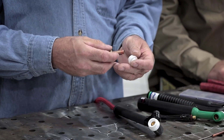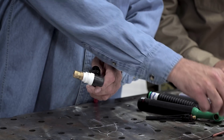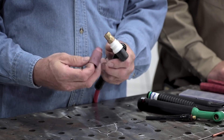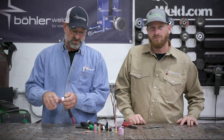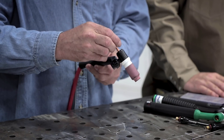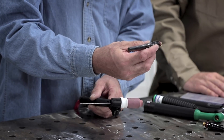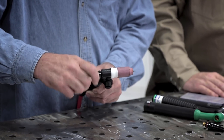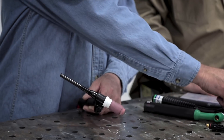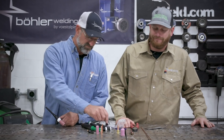Put the insulator on the gas lens and screw it into the TIG rig. This is the number eight cup - C8 - screw it onto the gas lens just finger tight. Then insert the 3/32 collet for 3/32 tungsten. For the cap back you have the full-size cap back, the shorter cap back, and the shorty - welders call them buttons. Remember: button, half rooster tail, full rooster tail.